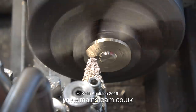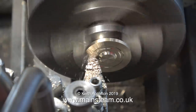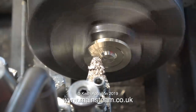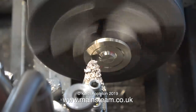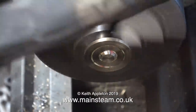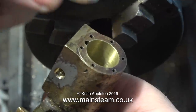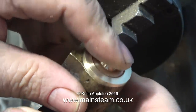I'm making it look like a cylinder cover — at the moment I'm cutting a shallow recess. It's important to make sure the distance between the outer part of the cylinder cover where the recess starts is the same distance as the mounting flange on the cylinder, so the bolts will be in the center. I'm doing all of this freehand; my calibrated eye from years of experience tells me this should be okay. If you're a beginner, it's a good idea to practice on a scrap piece of brass before attempting a proper job. I reduced pieces of metal to swarf for no apparent reason for about a year when I first started.